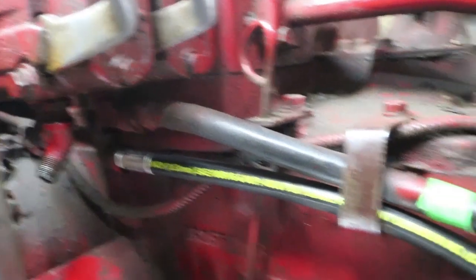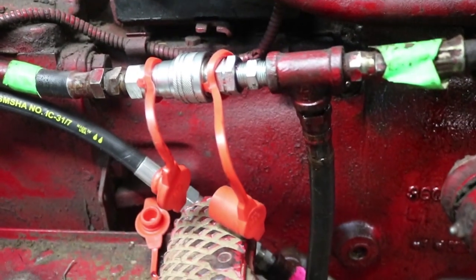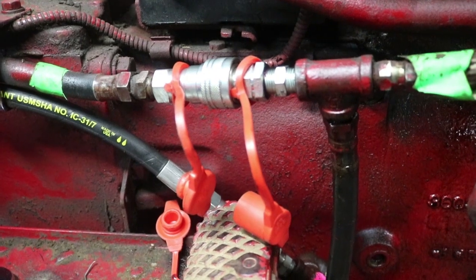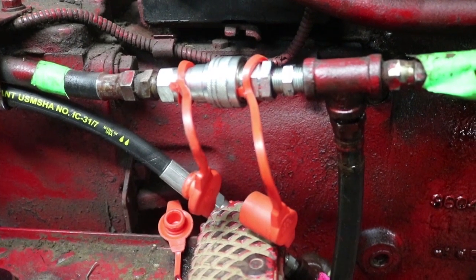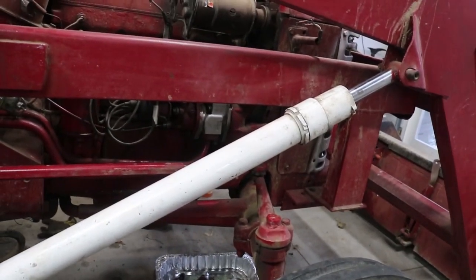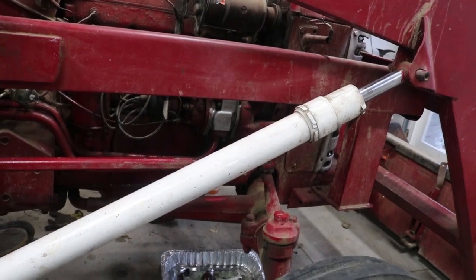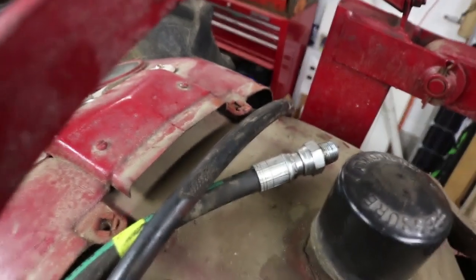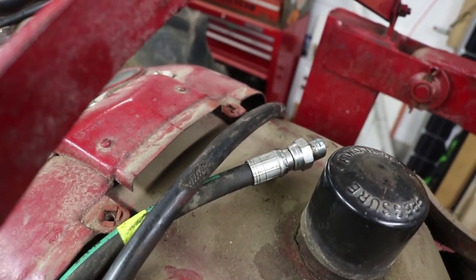So I replaced one hydraulic hose, and then I brought out the quick disconnects where they're actually easier to get to. This pair goes to the main arm of the bucket loader — the bigger hydraulic cylinders we see here, including the one on the other side, which I need to add some extensions to. So I've got the hoses coming up over the top and I'll add some extensions to those.